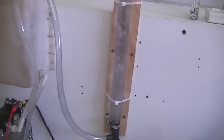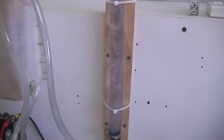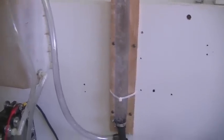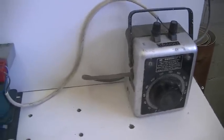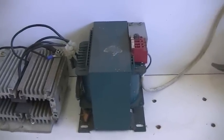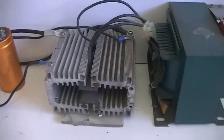Our cell is up and running. I'll run through the circuit we're using — we're doing straight DC testing. Here I have our little variac, that is going into a 24-volt transformer, heavy-duty bridge rectifier.